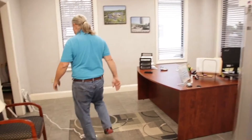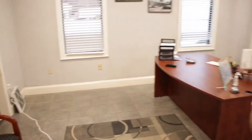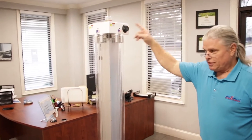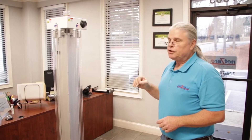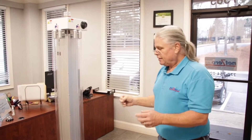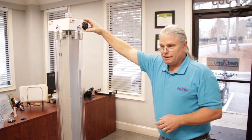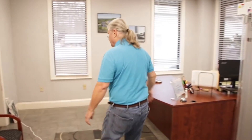I'm going to turn off the wall outlet — there's no green light. I'm going to come to the unit and turn the timer to the desired amount of time. Let's say for right now we're going to go 25 minutes. You can hear it's ticking now. So when I turn on that remote outlet, the unit is going to power up. The bulbs are going to come on. Immediately when the machine comes on, it's going to go through a reset cycle — the bulbs will illuminate, all the relays will activate, and it'll take a 30-second period for the unit to actually reset and come on for the extended run time.